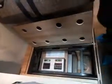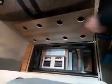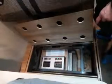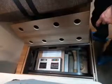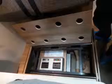That's just a light. So if you're going on the continent and you plug your electrics into theirs, come in here, have a look to see if that's lit. If it's lit, it is reverse polarity. They tend to wire it slightly different. Neutral and live are the other way round on some of the sites. If it is, it won't cause any problems, but you'll have to unplug it and get an adapter so you can use it.